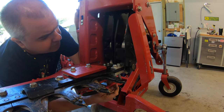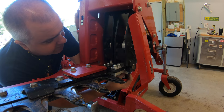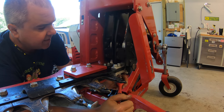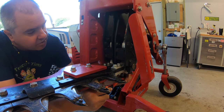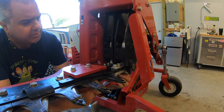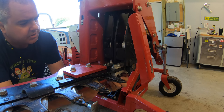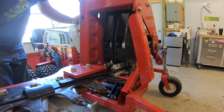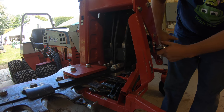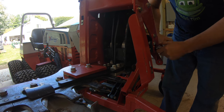I can see good from here—trust me, I'm going to take that thing up as evenly as I can. These were pretty tight, so I loosened them with this 3/8 ratchet and I'm going to tighten them at least as tight as it took me to loosen them. That's probably a good rule of thumb, though sometimes things are tighter after they've sat or maybe rusted. In this case I think it was in pretty new shape. Pretty straightforward.